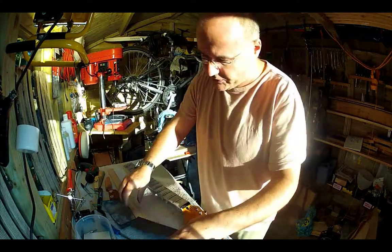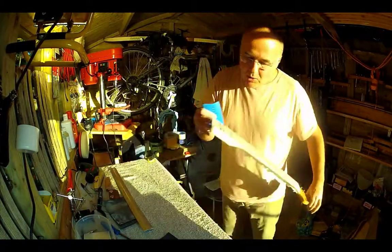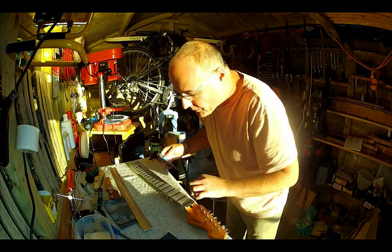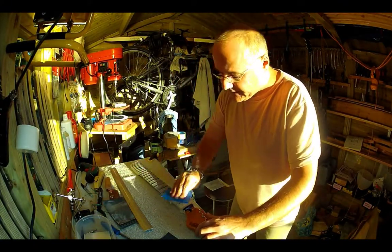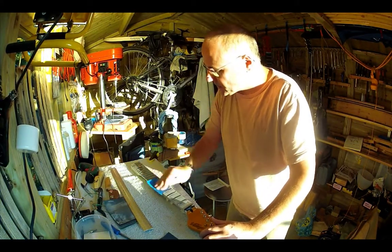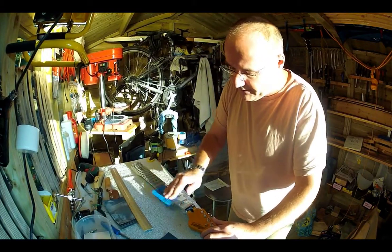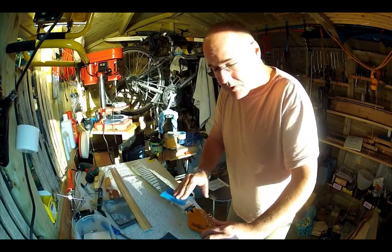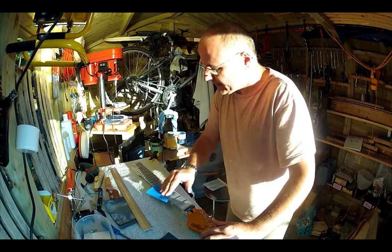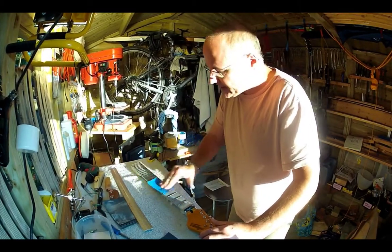Okay, and then I'm going to switch to 600. I'm just going to do it now by hand. 600 is still quite abrasive, so you don't want to do it too long on any one spot, since you don't want to introduce more unevenness, since we've just gone through all that trouble to cure it in the first place. But this 600 lets us take out the last gouges.